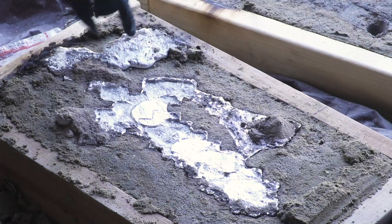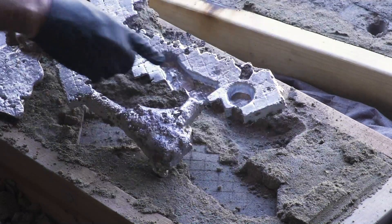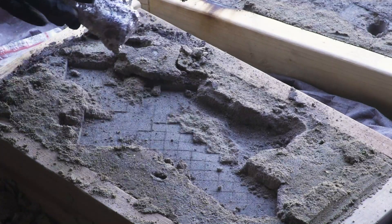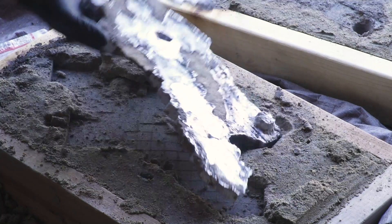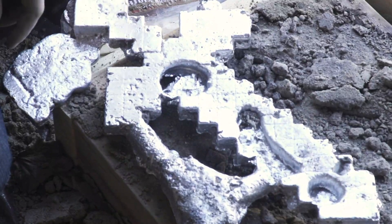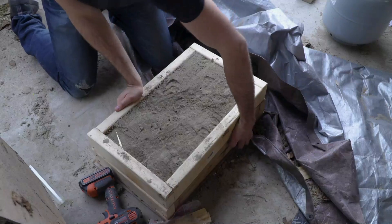That's sort of steaming — weird. There's not any sand there. I wonder if I didn't vent it enough. I feel like there's trapped air that the metal couldn't seep into. So close, but still not quite there. Now one last attempt with some added vents poked through it.